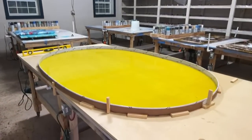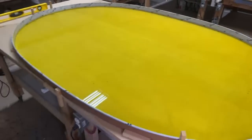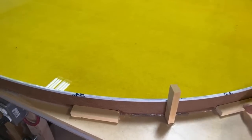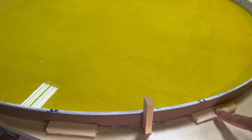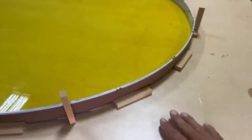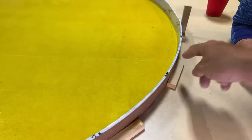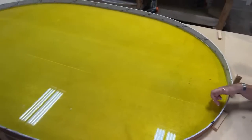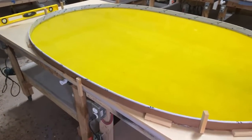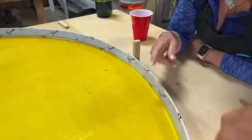This is going to be a coffee table that's going to be full of glass. One thing I did use - it was very easy - I used the 2P10 and glued these little blocks down onto contact paper. We put contact paper down first. You can see the difference right here. And then we just glued these down and made the circle all the way around - we basically built a mold, just an easy mold. Then I siliconed it on the inside and the outside, and on the splice I just taped it together.